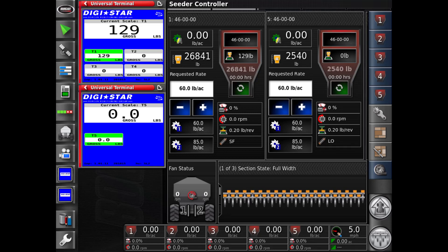This screenshot shows both mini views — tanks 1 to 4 on the top and tank 5 below. In the main screen, tanks 1 and 5 are in view. We can see the weight for tank 1 is the same in the mini view and in the tank, as well as tank 5 in the mini view and Cedar Controller view. However, if fans are running, there is a chance that these may vary somewhat due to the Digistar display not being pressure compensated, while the in-tank weights on the Cedar Controller screen are pressure compensated.